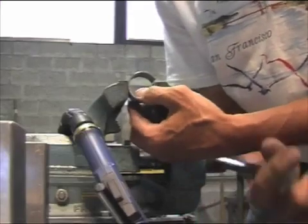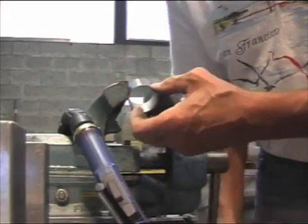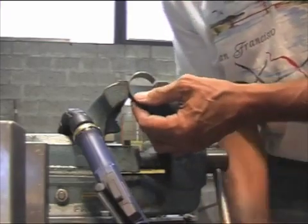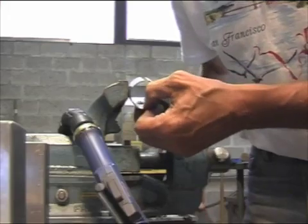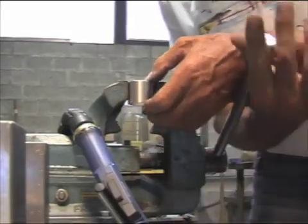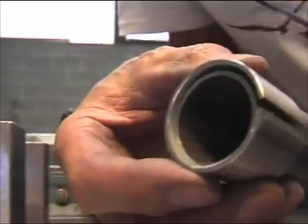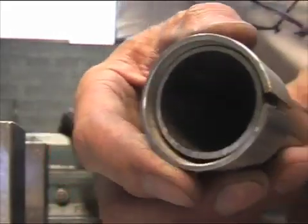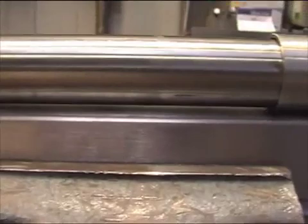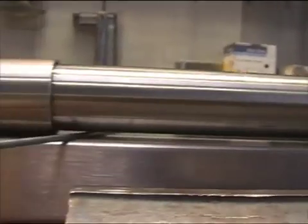I would like to remind you that this way to build a spiral is my way to do it — it is not by any means the way the industry does it. But I think it helps to know how to make it cheaply on your own and get some practice if you've never done it before, so you don't waste precious stainless steel. And there you go — you have a very tight fit, and what's important is that you have enough room in between so you can go through with the wire, as you can see.